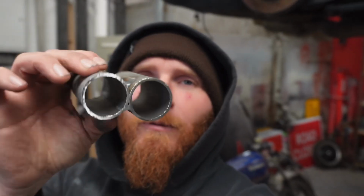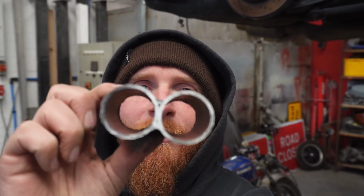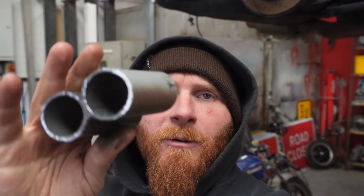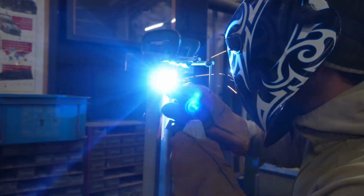Now in that video I did say I was going to make it more boxy, out of 5mm thick sheet metal, I think. If you can call 5mm sheet metal. I changed my mind. So in the end, I made it tubular. This is an offcut of it after I've trimmed it down. I've welded two together, this 1.5 inch pipe, about 3mm thick or something, which you can see Luke welding up by here. This was where it wasn't trimmed.